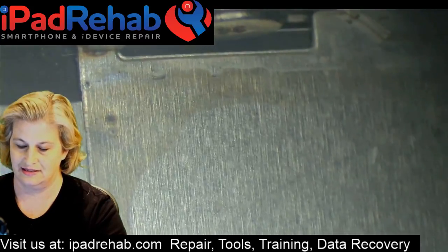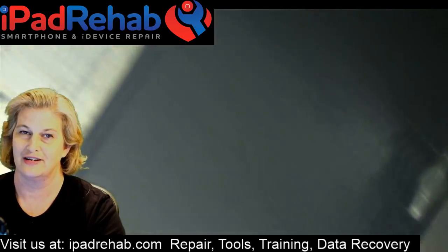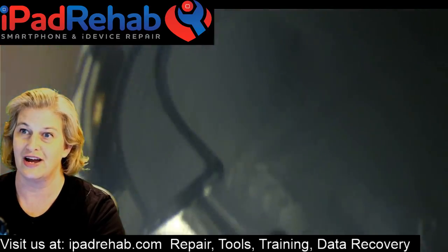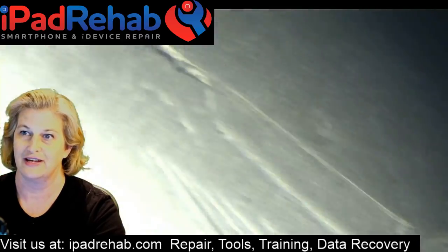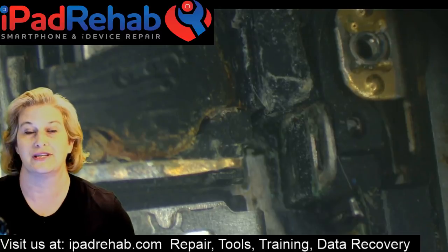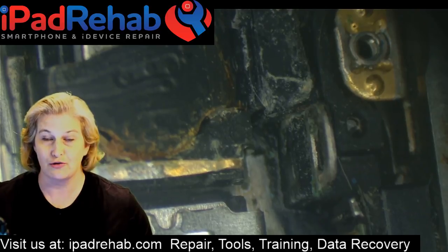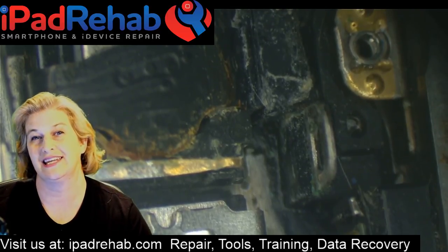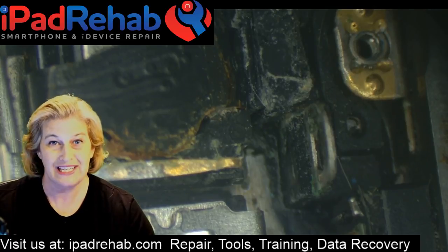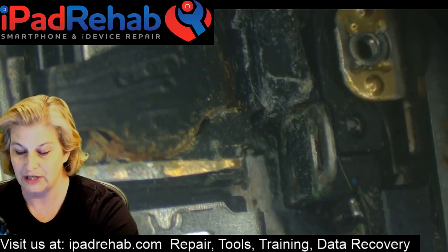And somebody got some bad advice from the internet, which is, if your phone's wet, you can just throw it in the microwave to dry it out. That is not true. Do not try that. If you put a phone in a microwave, it's going to catch on fire and make your problems a whole lot worse. We've done another stream where I put a phone in the microwave, so you can look that up on my channel. But what happens is the microwave will heat up antennas in the phone and make them get really, really hot, and that will burn through the board. So microwave damage can be really, really, really severe.